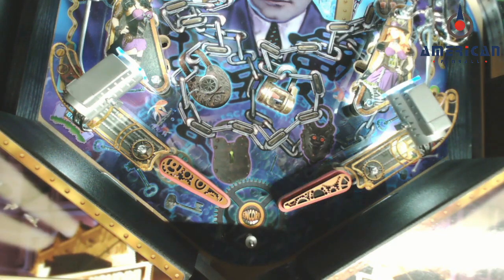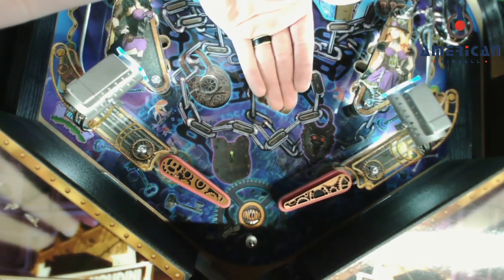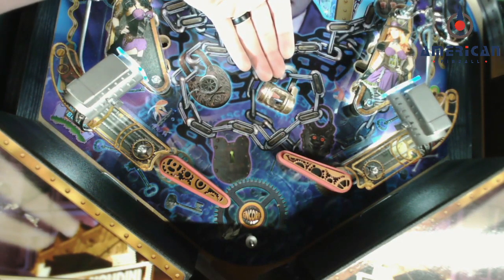Here's a demonstration of a flipper with and without an end of stroke switch. The flipper on the right does not have an end of stroke switch attached. So when you hold the right flipper button in the up position and a speeding ball comes down and hits it, it dies. And I am still holding the right flipper button. To get it to come back up again, I have to re-push the right flipper button.